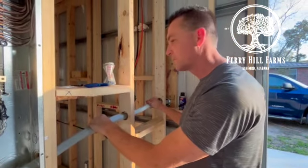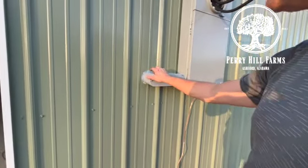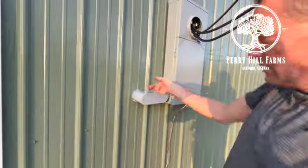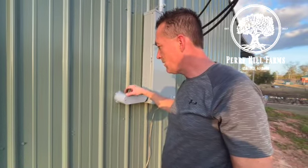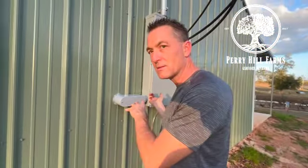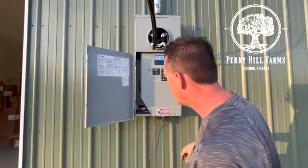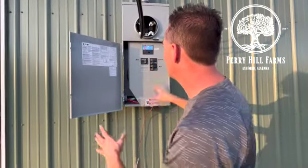So I had to make an adjustment — we had to come out the side, make a hole in the tin, and use a conduit box so I could get the wire through there. What I found out is that if I have the wire in a conduit box, I can cut that sleeve off and have the four individual wires, then run them one at a time. I could bend one wire at a time and get them in the box. The panel is on right now so I can't take it off, but these wires come in and are hooked into the panel.